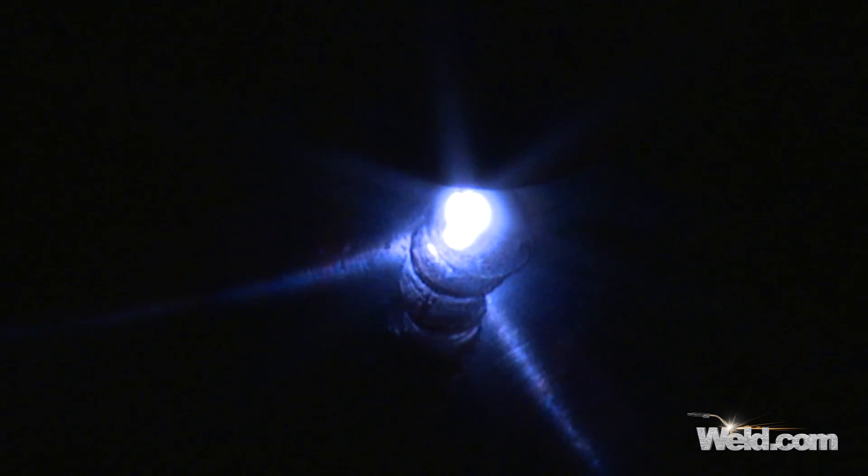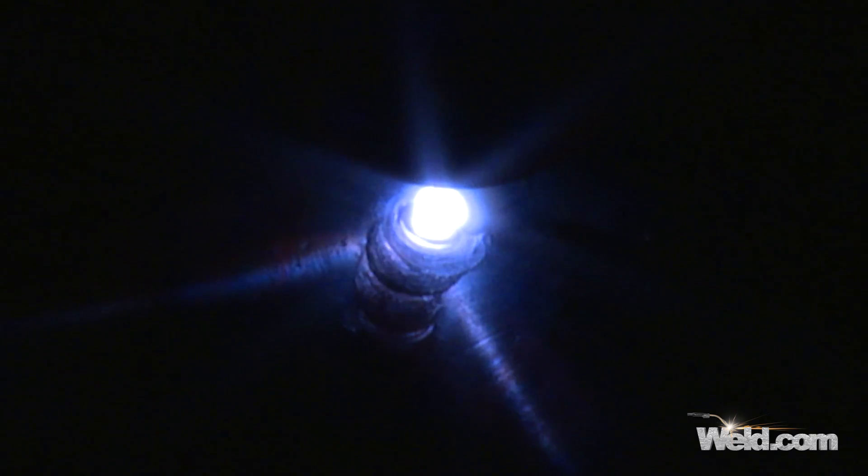Okay, I've already welded up the sides and I'm just getting ready to do the finish wrap around here in the front. And again, it just welds very nicely. You can see why fabricators like to use it because it is just nice and clean. Okay, so I'm tailing out — I don't want to leave a crater crack in here.